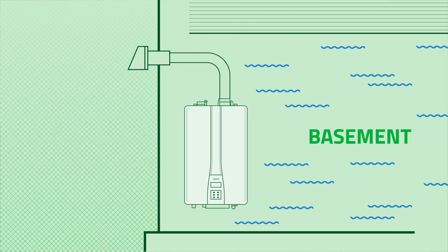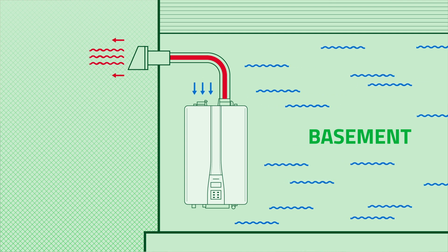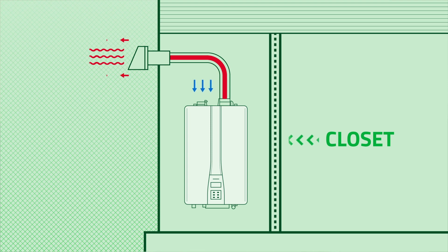There are two ways we can vent tankless water heaters. One option is drawing fresh air for combustion from inside the conditioned space. With that being said, we need to make sure that we have enough free space to draw air from. If not, you can create a negative pressure in the home and then you won't get the proper operation out of the system.